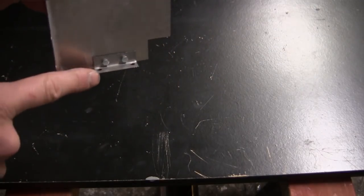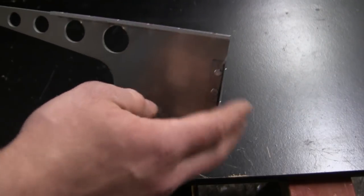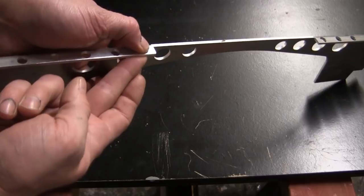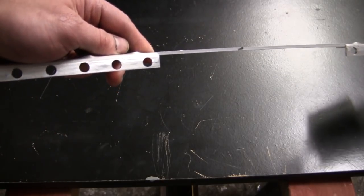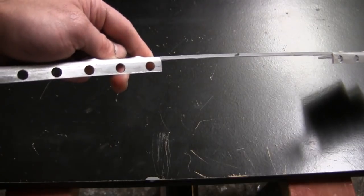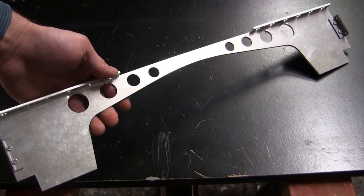To do this, I used two Armortech steel brackets on either side, which have been permanently bolted to the piece. On the tank, there are two or four matching holes that are countersunk into the plate to secure this permanently in place. I also modified the top portion here. This was originally designed to be bolted and sandwiched to the top deck and the engine grills. Rather than going that route, I modified the holes by making them larger so that when the fasteners get bolted to the engine deck — which hold on the cooling grills — they will simply drop directly in place and make no contact with the bulkhead, thus allowing the top deck to be easily taken on and off without being connected to the bulkhead, which will be mounted permanently inside the hull.